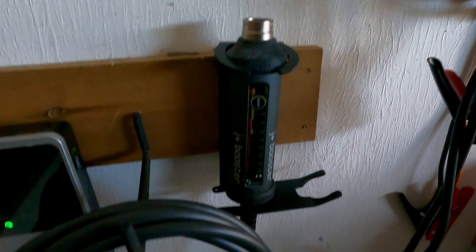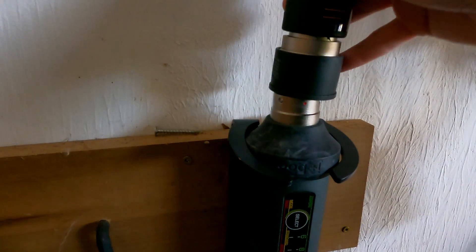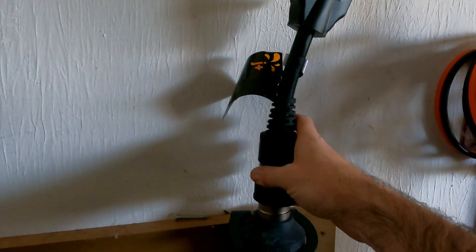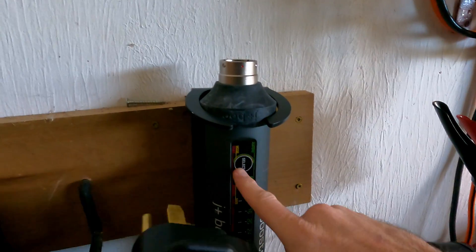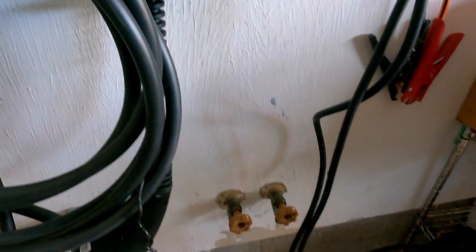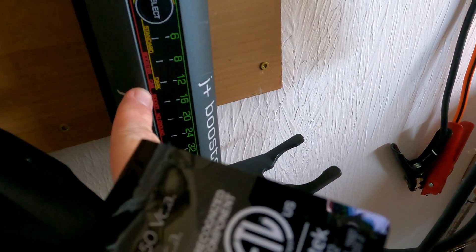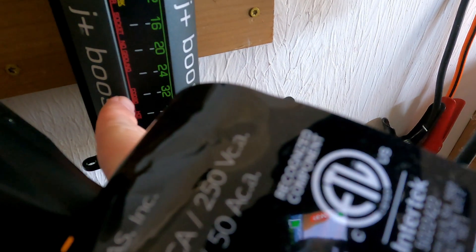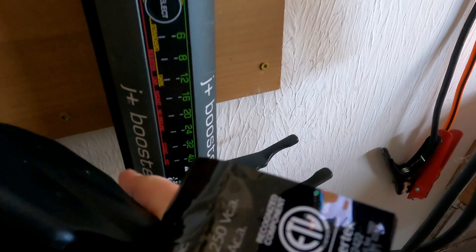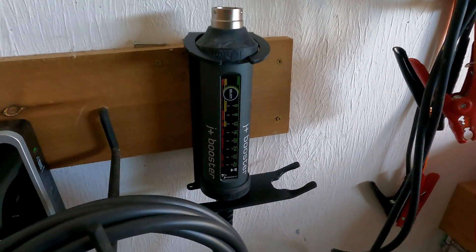The only limitation, at least in our application, is the outlet is down there and this is mounted this way — you could mount it the other way, although that wouldn't be ideal. You just have to think about where you mount it and at what level you want to access it. We've got a nice readout on here of the amperage, and the different fault codes: booster, car, socket, no ground, CCID 20, and hot — six fault codes on that line. We'll look at the manual to see the rest, but you can clearly see the different amperage levels.